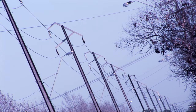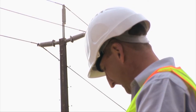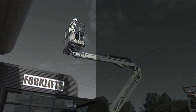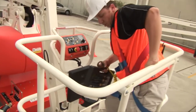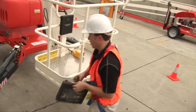Power lines present a major hazard to operators of all elevated work platforms. Whether inside a building or outside near power lines, the operator must remain aware of any lines near their working environment. Australian Standard 2550-2002 states that the minimum distance from distribution lines should be no less than 6.4 metres from lines on poles and 10 metres from high voltage transmission lines on towers. A trainer or the owner of the EWP will advise you of any state-based variations and on the use of spotters. An operator should stop using a trailer lift or any EWP if they deem the situation to be unsafe for any reason.